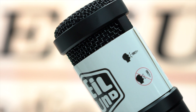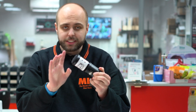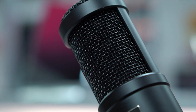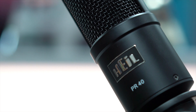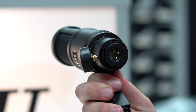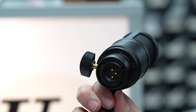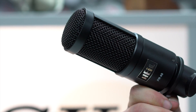And that's the microphone itself. It's got a warning on it that you remove, just telling you that you actually speak into the end of the microphone, not the side, because it looks very much like a condenser-type microphone. It's important to know that it is a dynamic microphone — therefore you don't need phantom power with it, which is why it's perfect for amateur radio use. There aren't many radios on the market that will provide 48 volts phantom power. It's also perfect for broadcasting and maybe using it for podcasts. It's got your standard 3-pin XLR on the bottom and a fairly standard mount as well. That's the brand new all-black version of the PR-40, now available from stock.